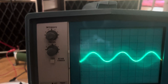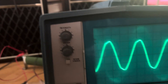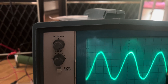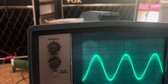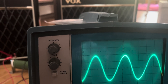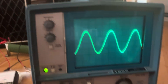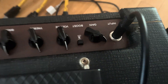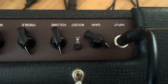Let me put the volume at about 11:30 — this is how the controls look now. I'm going to push the gain until it starts clipping. Let me fix the waveform, get it as thin as possible. I'm adjusting the volume trying to maximize clean headroom on the amplifier. So that's about the cleanest from the preamp at that position — gain set about like that, and that is the Stratocaster-level input.